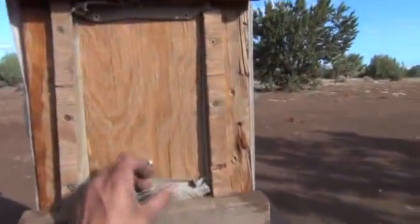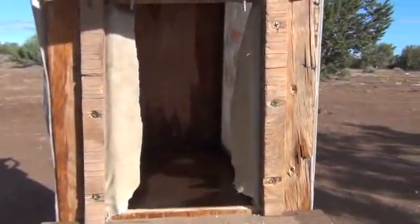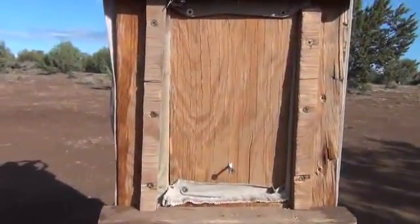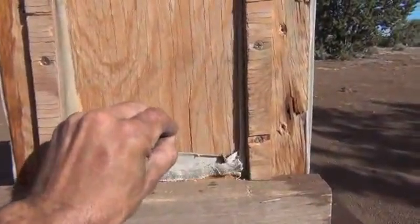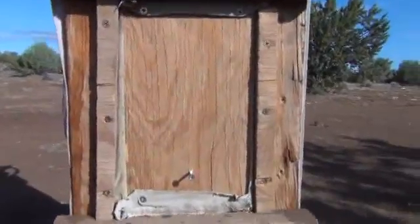Let me show you the door here. You can see some cloth panels on the sides that make a nice seal. I made this large enough that I could put four gallons of milk in there and keep them on a 96 degree day down into the 60s — not going to make it last very long, but a few days longer than at 96. You're actually getting preservation on the food. Vegetables are going to stay for a very long time inside this box; the moisture and cool temperatures will actually keep vegetables upwards of a month. It's really simple to build — I just have cloth hinges, cloth sides, and a cloth flap at the bottom. You can splash that with a little water to help seal it up, swell the wood, swell the cloth.